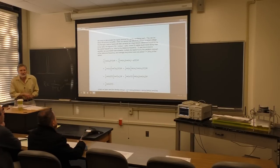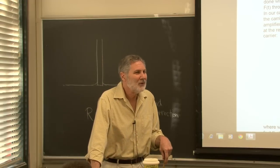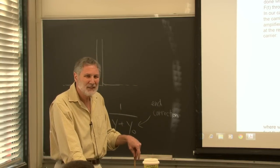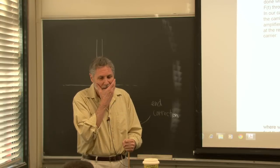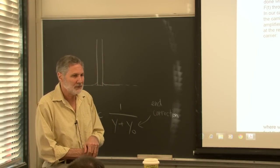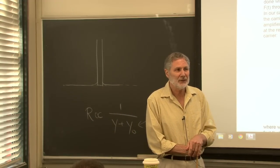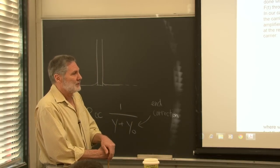If you guys use that in the acoustics lab - an FFT analyzer - this is probably the course where you first use the analyzer. It's a big box that does fast Fourier transforms - you can see the spectrum. These are very common boxes everywhere, very convenient. But I've got to warn you, no piece of equipment is perfect. Every transducer has its limitations, and that's one of the reasons you're taking this course - to understand the limitations of transducers. It holds true with any experimental piece of equipment.